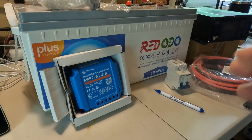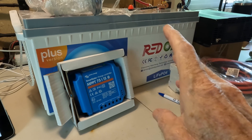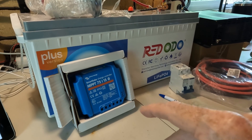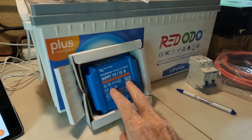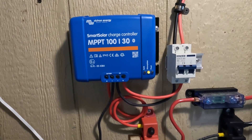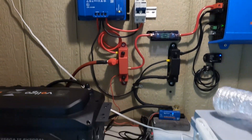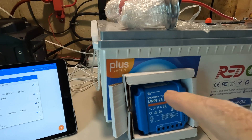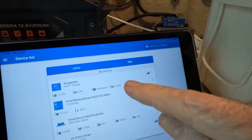In the previous videos we were going to try to get a few hundred watts — at least 200 to 300 watts of solar — coming into your little backup system to run your refrigerator, your freezer, maybe do a little cooking. This is going to work for that. If you need a little more solar, you might want to go with a bigger charge controller — the 100/30, which is $123 today. A lot of people say Victron's too expensive, but I don't consider that too expensive for the brains of your system. Once you have this plugged in, you can just look at the Bluetooth app.